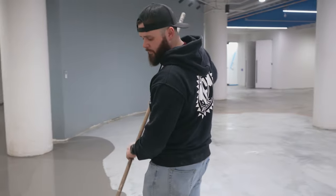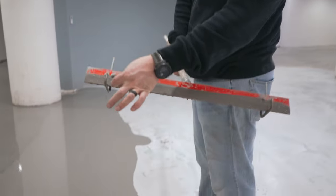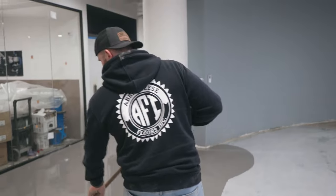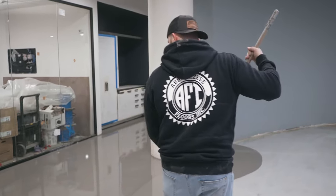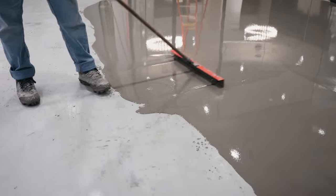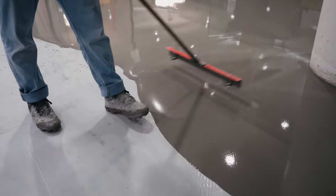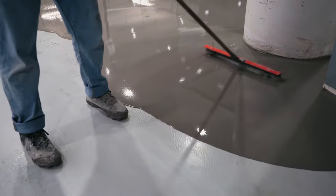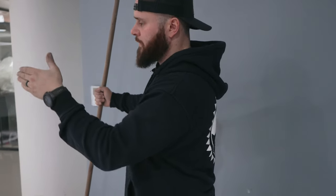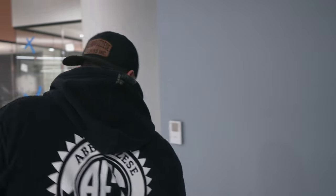This tool — the gauge rig — you set your heights here, and the height you're pouring is the difference between this point and the bottom of the ski. We set it right between a quarter inch and three-eighths. You want to overlap a little bit and just pull it back nice and steady. You don't want to pull too hard or you create a tidal wave. On a big wide open span, don't pull too far — if it's hot out, your wet edge is gonna start to set up on you. That's a real hairy situation.